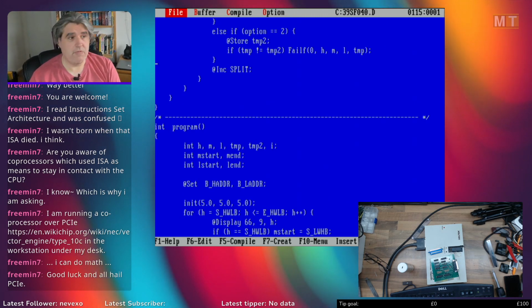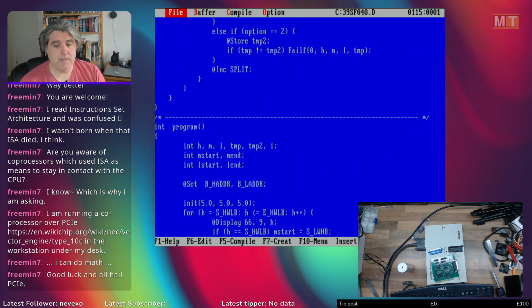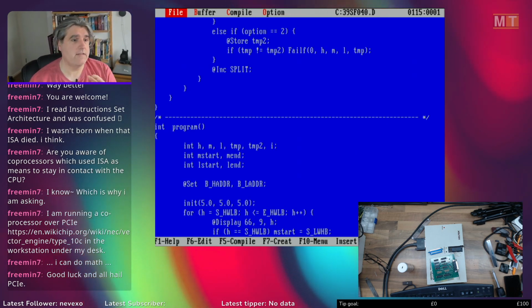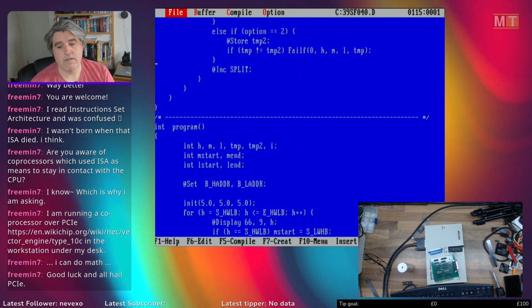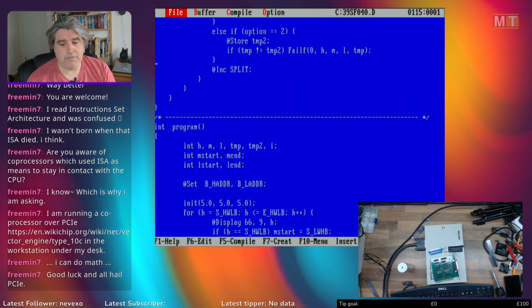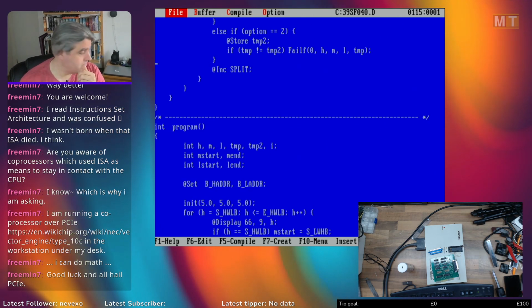How it operates is very simple. The ISA card is very much a dumb device. It performs 3 basic operations. It has a pulse generator for the IOCHRDY signal to slow everything down. It has buffering for the data bus and some address pins, and it has a small amount of address decoding logic.